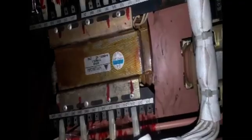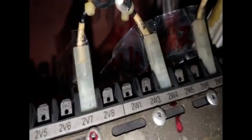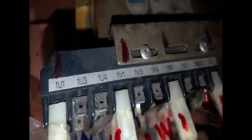If voltage is hunting on load, check the cable connection between main current transformers T1, T2, and T3 output and rectifier transformer T6. Check whether there would be any discolouration caused by excessive heating on the rectifier transformers, on connectors, or anywhere else.